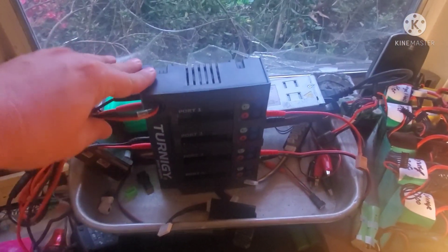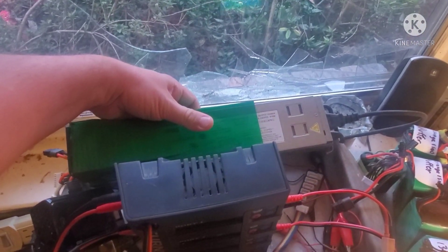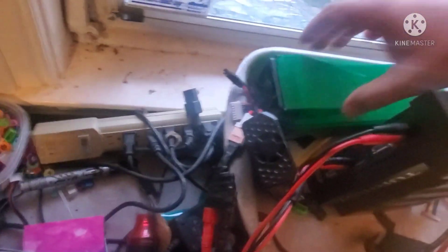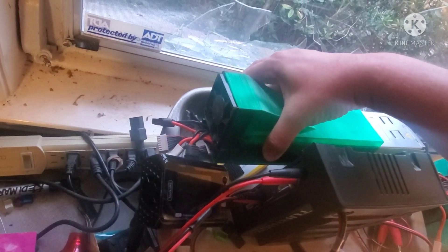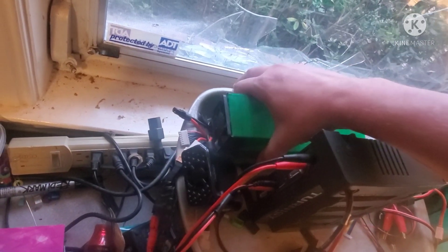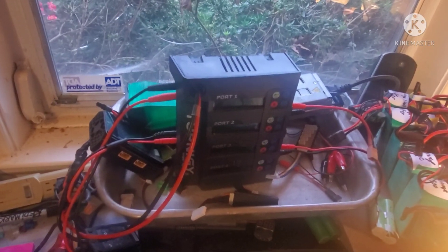Well, I don't — at home, here's what I rock, and I take this to the field with me as well. This is a 670-watt power supply from an HP server. Dell server power supplies work great too, but I have modified it so that it has three XT60s pushing the power out at 24 volts. I've also added my own fan and a cooling shroud to help keep it cooled, since most of these power supplies have built-in fans but mine does not.